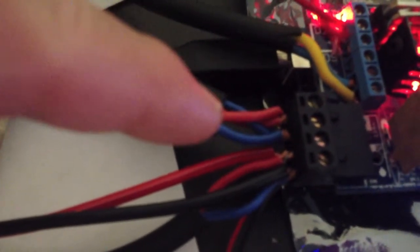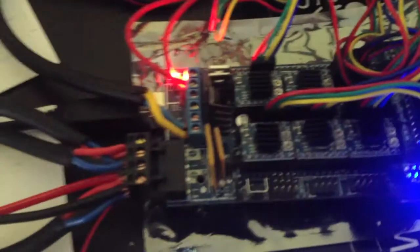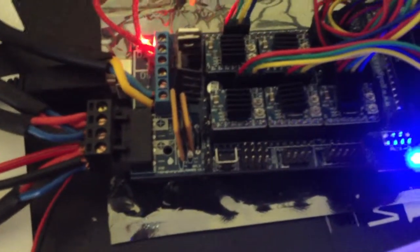It goes out to a regular computer power supply — I got that from my old computer. You wire it up right here. The first two pins are positive, negative, and then positive, negative — they're actually bridged, so those two pins are the same two pins here, and that's where I have the fan connected. This handles the heated bed and the hot end, the stepper motors and the stepper drivers. The thermistors are in the back right down here, and the end stops right down there. That's how you get power to your Ramps 1.4.